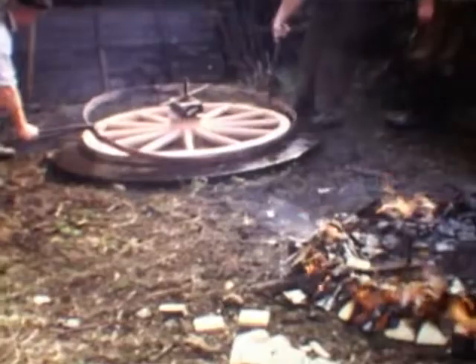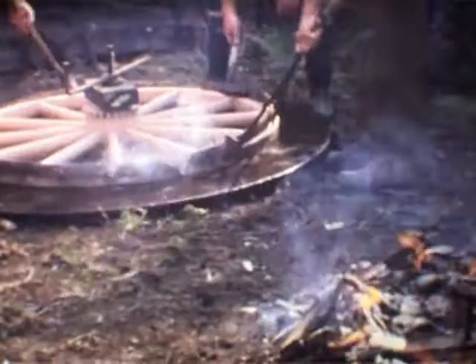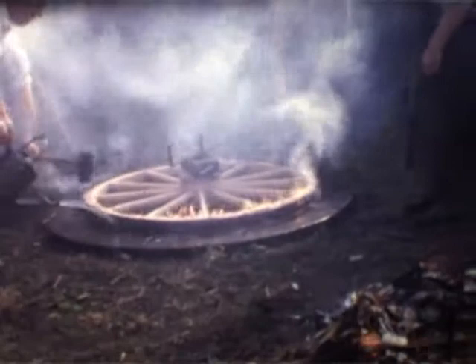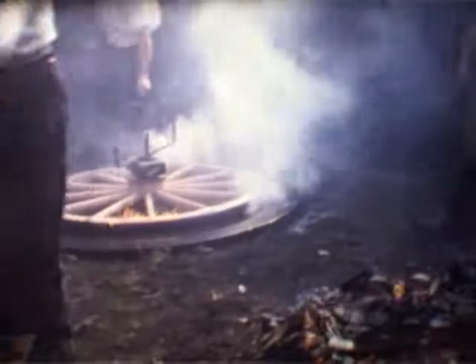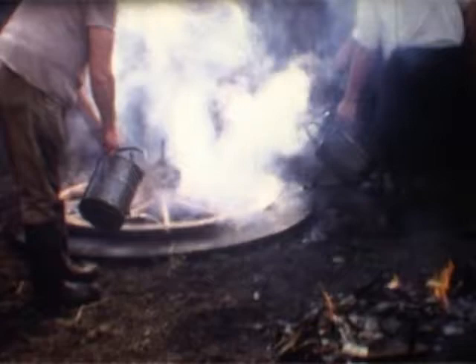There's another tire going on. Sometimes they don't go right, sometimes they go on straight away nicely. But then they knock it in. That one looked as though it was a bit tight, so they have to use some prongs to pull it a little bit tighter to that side. There it is now, it's all round — the sides and the spindles are all knocked out. Then of course the water comes quenching around again. There's a flame — if you let a flame go too much, it burns too much wood away, and then that's a loose tire. Some people call it a tire, some call it a shoe, some call it an iron band — but whatever it is, that's what goes on the road.